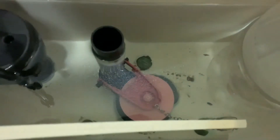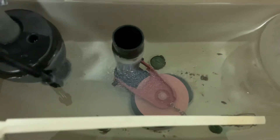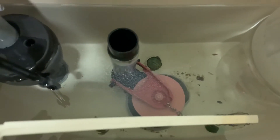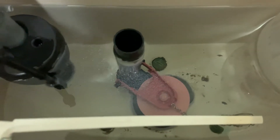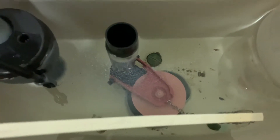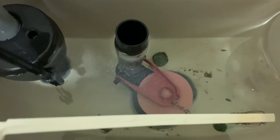The first one is you check the flapper right there. Sometimes when it builds up some calcium — especially if you have a house with untreated water — it gives you calcium buildup and then the flapper opens up. But this one is clean, it seals perfectly. So what's the real culprit that I have here in my toilet is this thing right here.